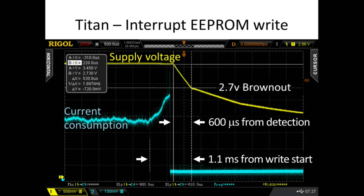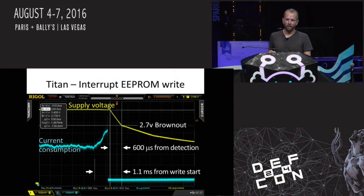So you put this all together, and what this lets us do is have an infinite number of attempts to guess the key code. You go through, say, 4 attempts or 5 attempts, and then you reset the invalid attempt count back to zero. So this allows us to both get the 6th digit and also more efficiently search for the first 5 digits. The reason it helps with the 6th digit is because we just want to brute force that. We want to go through and try, knowing the first 5 digits, all the possibilities for the 6th digit. So we'll just go through, try each of them, and periodically we'll reset the invalid attempt count and just keep going through all 10 possibilities for that 6th digit.